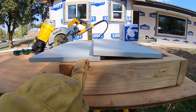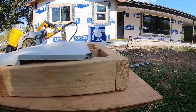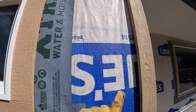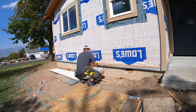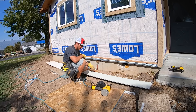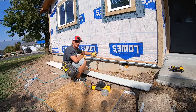If you look closely at our model, this first piece that I put down is perfectly flat and the second piece starts the angled look that'll carry all the way up the house. I don't want the first piece to be flat like that — I need to match that angle from the beginning, so I have to put a backer behind it. I'm using the same shims we used on our trim and corner boards to fur the bottom layer of this board out as well. With all our base level set and prepped, we are finally ready to start putting up our Savannah Smooth clapboard.